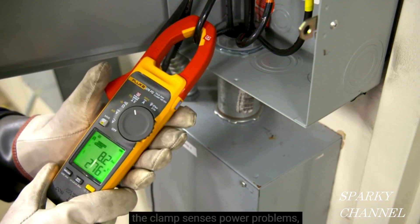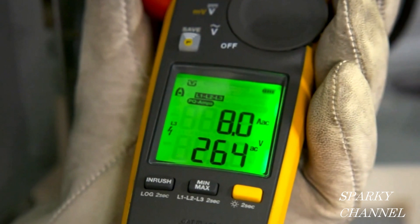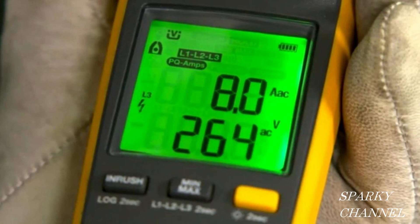The power quality indicator shows whether equipment or the power line is faulty. The field sense symbol shows that field sense is engaged, and another symbol shows that there is a live wire in the clamp jaws. L1 indicates that we're currently testing line one of a three-phase circuit. You can get all three readings for a three-phase system very quickly — first attach the ground lead to any ground, then use field sense on all three lines. The display turns green when a stable field sense measurement is detected.